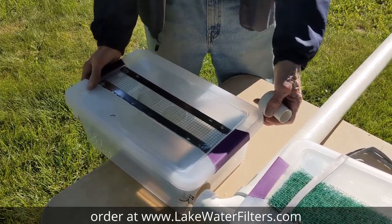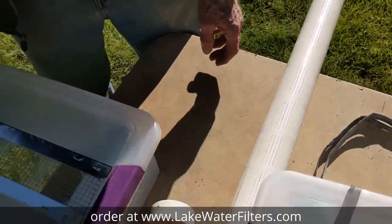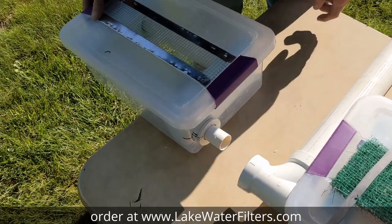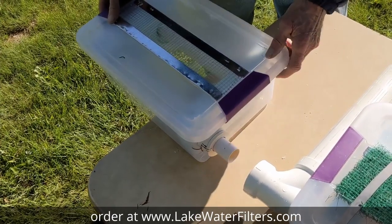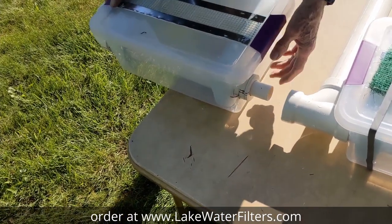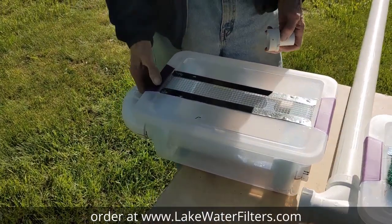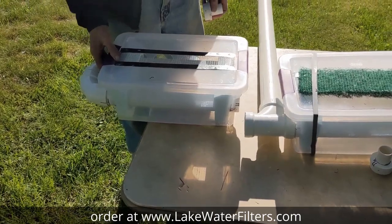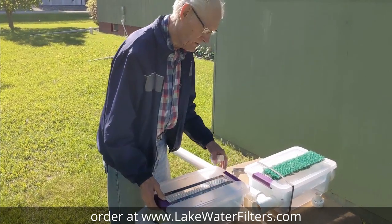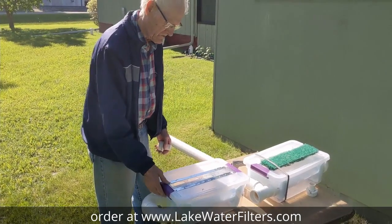But I would have these so that they are easy to take apart. So you have this, and then you have a hose with the check valve in it, and then it continues on and goes to the pump above ground. Or if you have a submersible pump, you don't need the check valve and the prime and all that. That's built right into the pump. So if you have a submersible, it's a little simpler then, I suppose. My nephew's had that in Detroit Lakes, and that's worked real well for him. I thought I'd just review that.